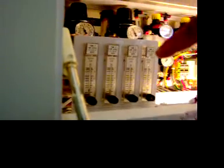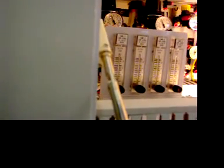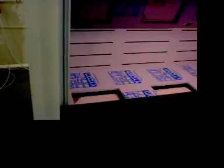And the flow meters need to be set like 0.1 to 0.3. You don't need more than that. That's more than enough. 0.2 is more than enough. If for some reason you have the tubing inside the chemical and you have the pressure and you still have an alarm, that means you have either a loose fitting or low N2 supply from the facilities.